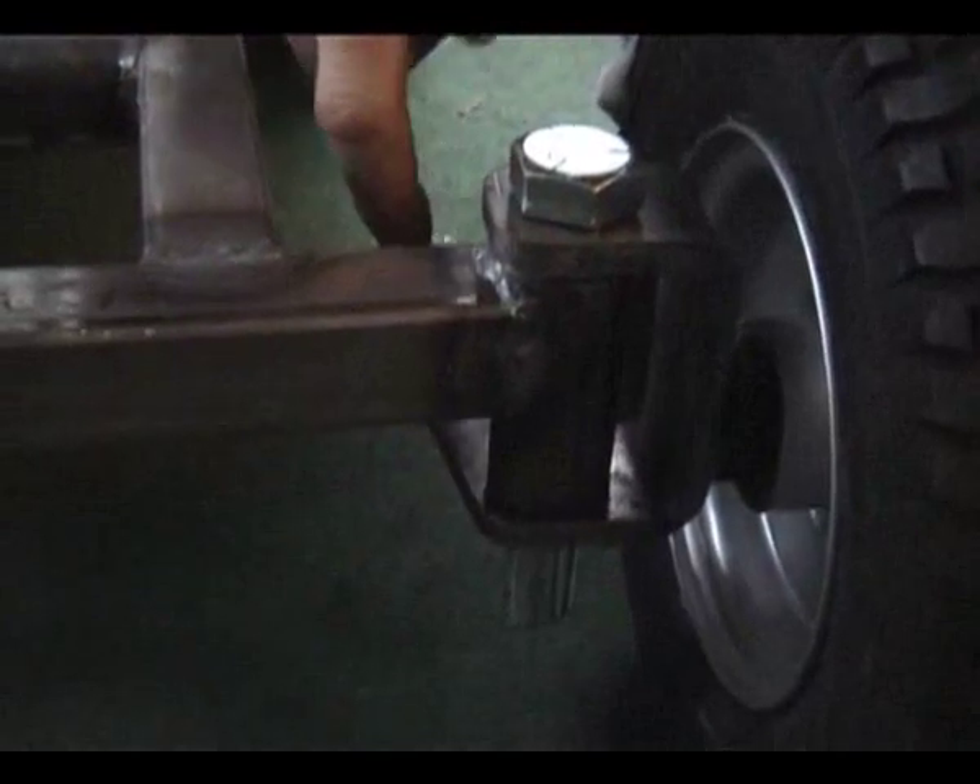The main kingpin bushes are a nylon bush and don't really require lubrication other than the initial lubrication. But the rod ends themselves — lubricate those with an oil can as well and work the steering so the oil gets into the joints where it's needed. Again, certainly once a day.